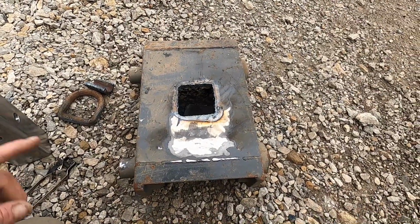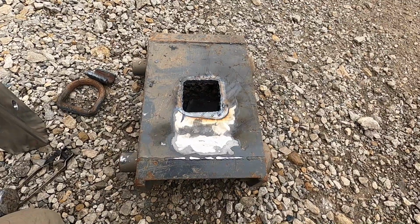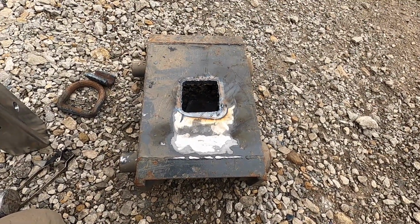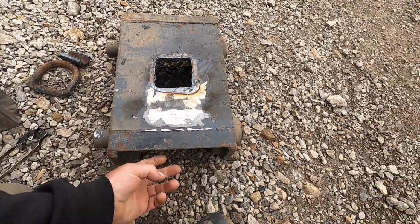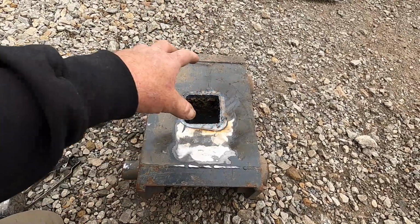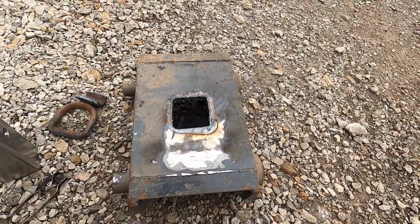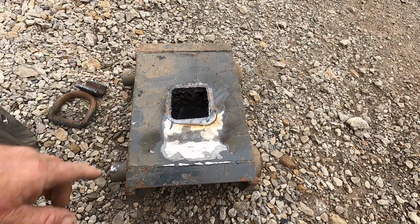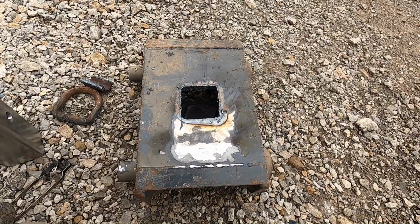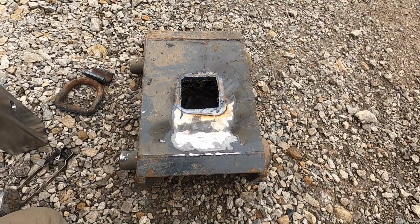Absolutely amazing. That's right. I'm gonna get this cleaned up real quick, and we have a welder, and that's what we do with the welder, we weld stuff in. So I'm gonna figure out something to put underneath to kind of space it up so I can drop the tube in there. I'll square it and I'll tack it on both sides, flip it over, tack it in a couple more spots. I kind of want it fairly plumb for what we're using it for, and we'll go from there. So give me just a few minutes.